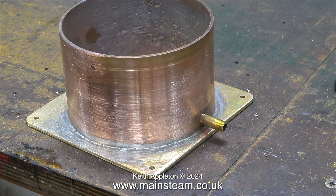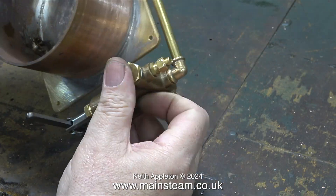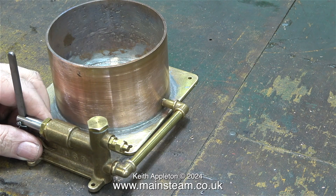These are PM Research components. Now what I'm going to do is fit an elbow on the end of the piece of pipe. But now the opposite is a problem — the piece of pipe is too long. I'm going to cut the thread a bit longer and shorten the pipe. Here I'm assembling the pump to see how it all fits together.